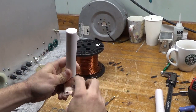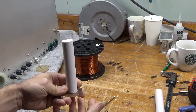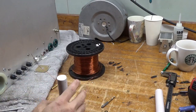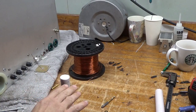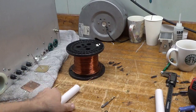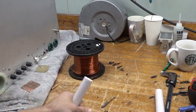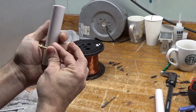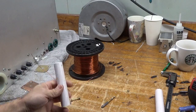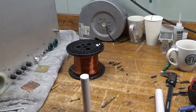I'll have a connection coming out from the center point which will be soldered, and it will connect here. That keeps the RF current equal among the four caps. This connection point will be almost flush with my connection point on the side of the tube. The reason I go with a nylon bolt is so I'm not bringing ground potential close to the horizontal screw here. I've seen people use metal ones and that's a bad idea — normally this would be mounted to the chassis and I don't want to bring them close to each other.